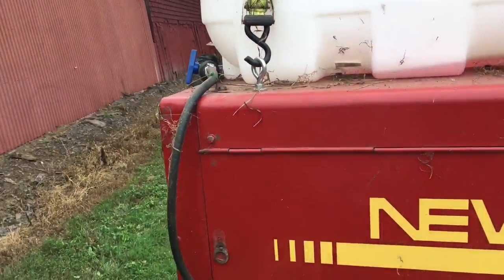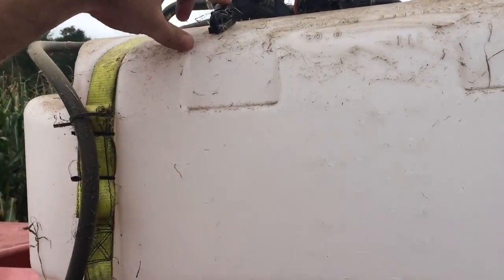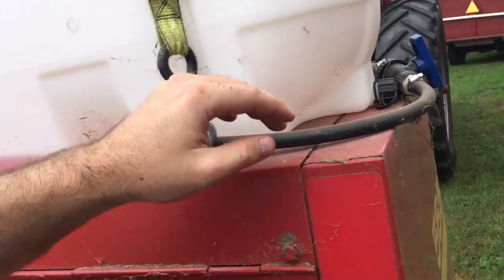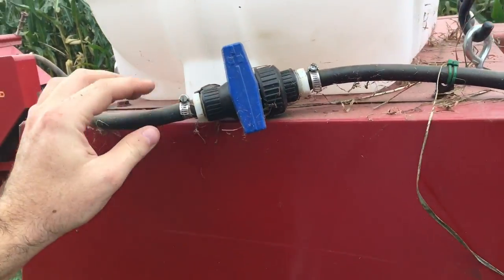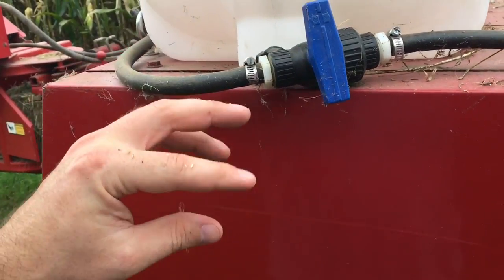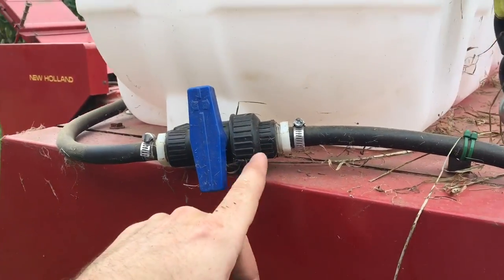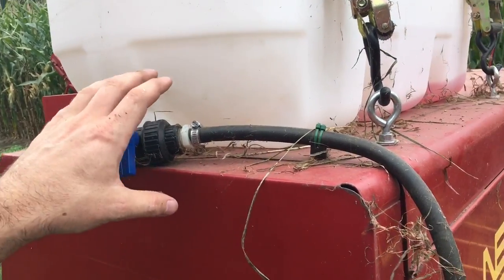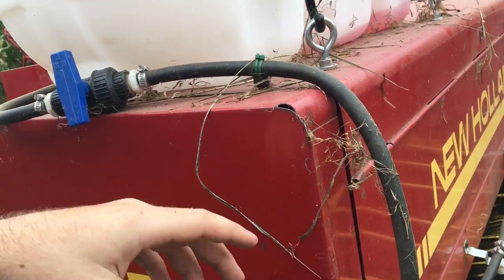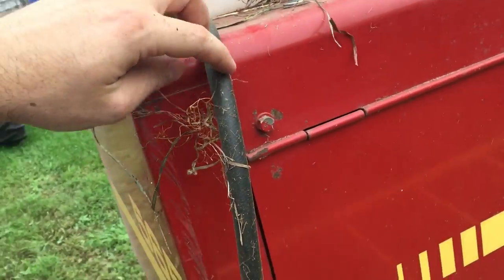They gave you a 30- or 50-foot hose with a wand. The hose comes out of the regulator valve and I cut it to length. I decided I wanted a shutoff because these aren't no-drip nozzles — so here I can open or close it. This was a fairly cheap shutoff. I also wanted a way to disconnect it without undoing everything, so you just unthread it here, take your ratchet straps off, and I can pull the whole tank off and leave the hose behind.